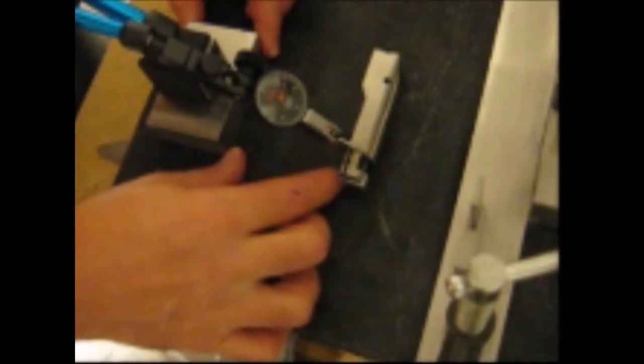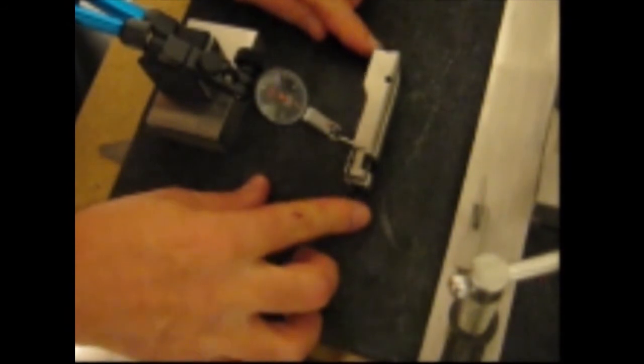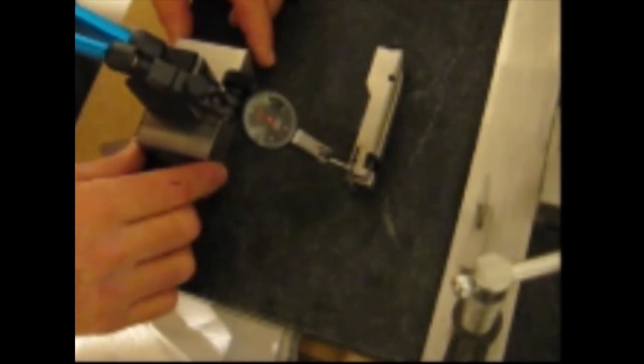Let's exit. We enter again and you can see we're back to the 15, right on the nose — that's the repeatability. We'll sweep this way and we get a difference of about 2 thousandths. We'll sweep back the other way, and at the end of the bolt we only have a difference of half of one thousandth — 5 ten-thousandths. So that's a pretty good sweep.